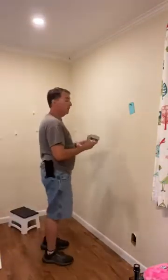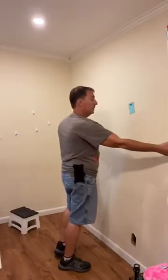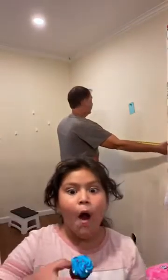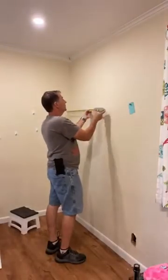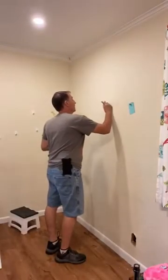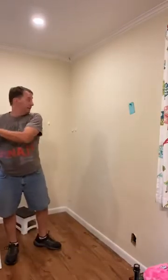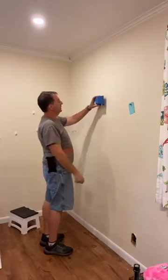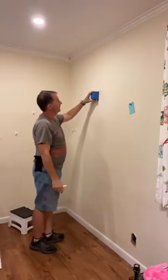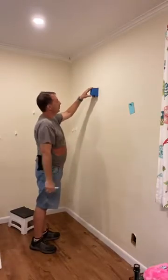I want to find the center of this wall because her dresser is going to take this whole wall — 74 inches. So I'm going to mark 37 inches, right there. That's probably where her bracket's going to go for her TV. I don't want my outlet to be right there because then I can't hang the TV in the middle. I'm going to put it up here where you won't see it and where it won't interfere with the bracket.